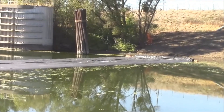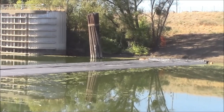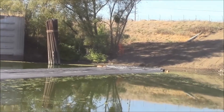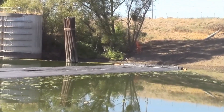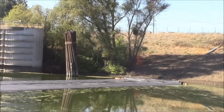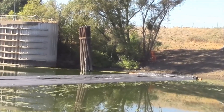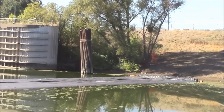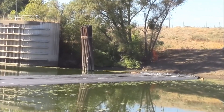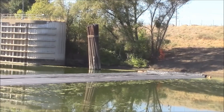As the tide comes in, the head inside the aqua dam dissipates and reduces. In fact, you can see part of the aqua dam in the deeper middle has actually become flaccid in the water. So it's time to put more water in the aqua dam. All we need to do is keep it a couple of inches taller than the surrounding water and we will have achieved control and independence from the surrounding water column.